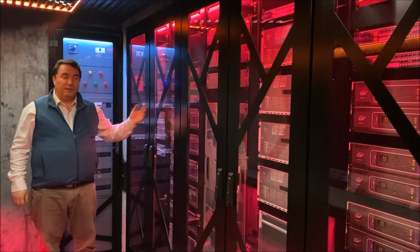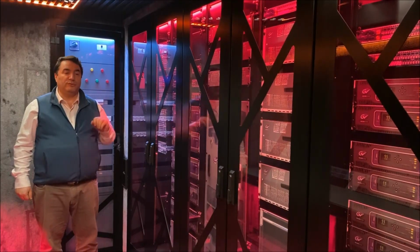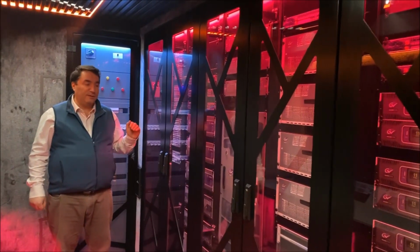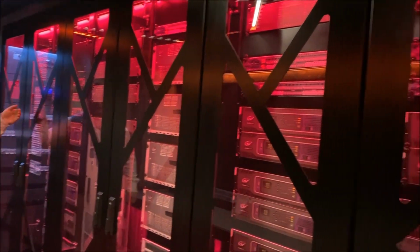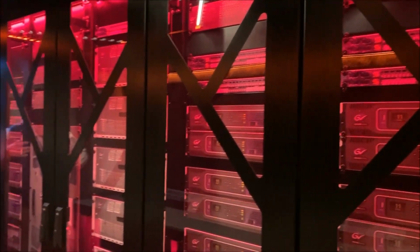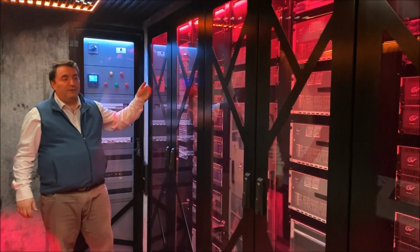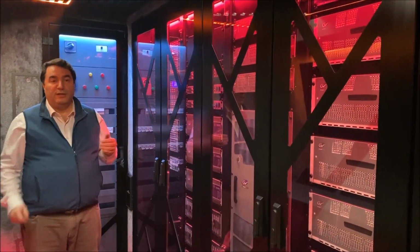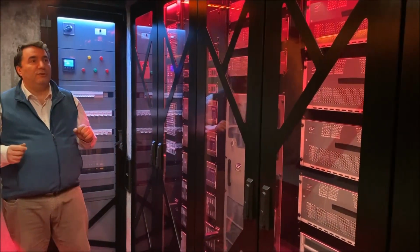In the technical equipment area, we have 6 racks, each of them with 42 rack units of available height, and all of the racks are 80 centimeters deep. But of course this screen in front of them is also another roughly 15 centimeters away, so that if you have some devices with bulging fronts, this is again no big problem. Also, we will show later, but on the other side we also have another 7-8 centimeters of freedom at the back of the racks. So if you have again some bulging equipment exceeding 60-80 centimeters, that is also not going to be a problem.